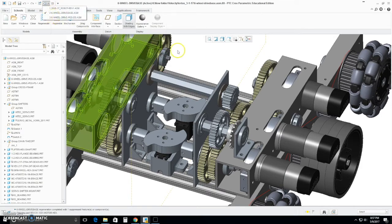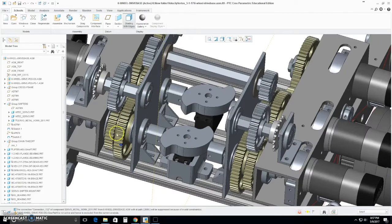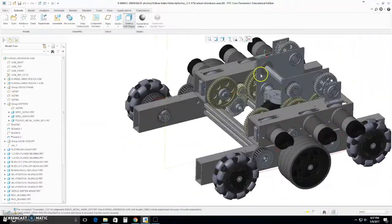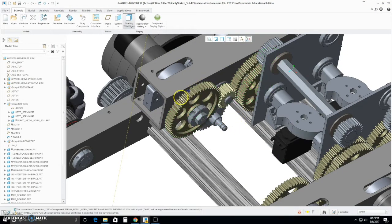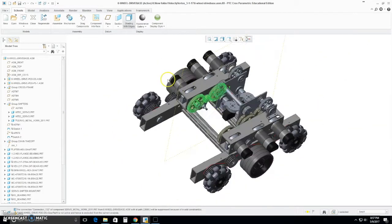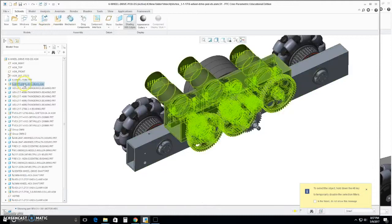You can see how this gear here is geared all the way across the other side. The center shaft here would be rotating, as well as the gears on this side, whereas the drive gears are connected together here with the rear set of gears here and here and here are connected together, so these allow it to connect down to the main drive wheels. Now, to get into more of how the gearbox works, we'll go into here.